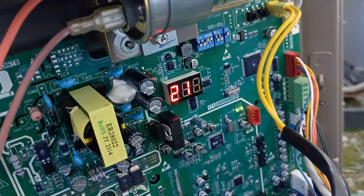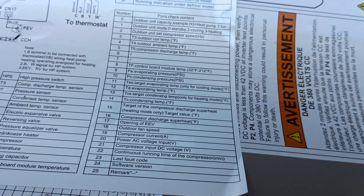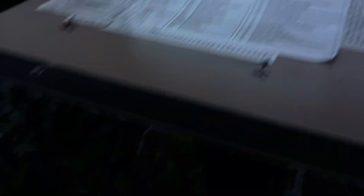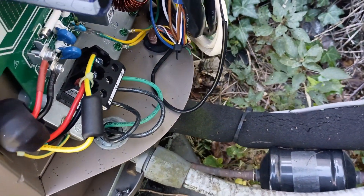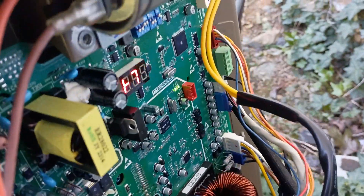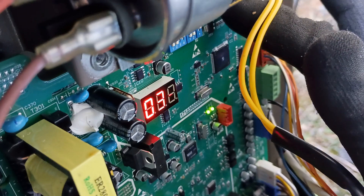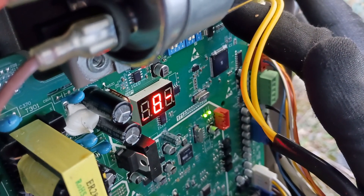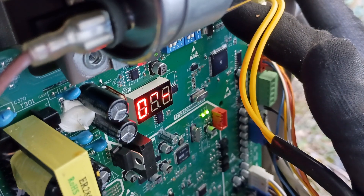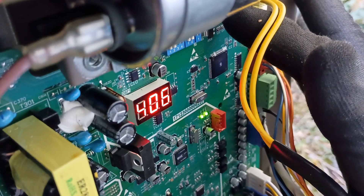That'll end your career. So that is where you scroll down through the parameters and check all your stuff. You really don't even need to gauge up on them — it's going to give you pressures and temperatures. Number eight is the module temperature, so this module is running at 77 degrees. There's nine — that's our suction, so we're at 116 psi.